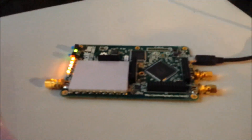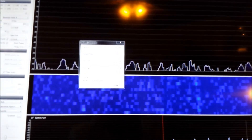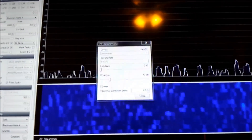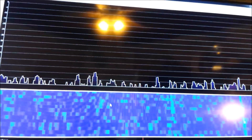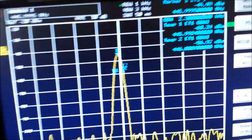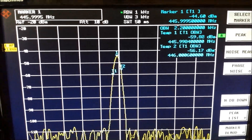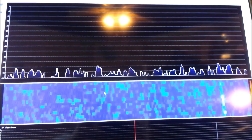I got some news for you. Number one — I didn't smoke it, it still works. We're tuned to the same frequency and you can see the gain is set the same: 0 LNA, 12 VGA. No carrier here. It works great. Same setup — zero dBm, 446 MHz — and same setup here. It's still right around negative 44 on the spectrum analyzer with the antenna. So the RF is still there. Look how quiet it is — not even a trace.